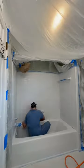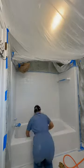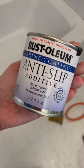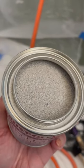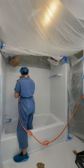First of all, I accidentally grabbed the wrong finish — you're supposed to use gloss, but I bought the semi-gloss and was not able to return the product. Based on my research, since this paint is meant for boats, it's recommended to get the non-skid additive and add it to the bottom of the tub where your feet are going to be. Because I used semi-gloss, I was hesitant to even add it, but since I already had the product on hand, I figured it doesn't hurt to add it.